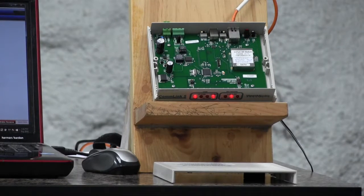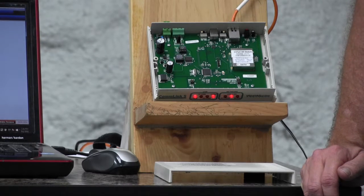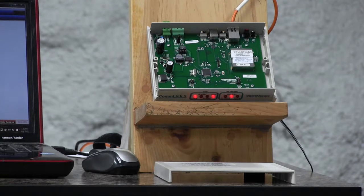At this point we need to find out a few bits of information. The IP module comes from the factory with a default IP address of 192.168.1.25. You're going to need to get from your customer an IP address they assign you, a default gateway, and a network mask — those three pieces of information are needed to configure this. WattMaster cannot supply this information; it has to come from the customer's network.